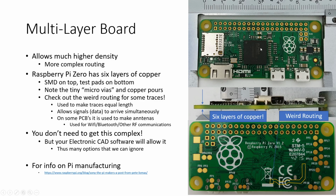If you look at all of the vias taking place right here and how they manage to transfer those signals back and forth, some will be transferring the signal to the second layer, some to the third, some to the fourth, some will go all the way through to the bottom and transfer it down to the sixth layer right here. And here you'll see a lot more use of copper pours. Copper pours in our previous image were primarily being used for heat dissipation, but I suspect in here they're being used to suppress electrical noise because we've got some very high frequency signals coming through here.